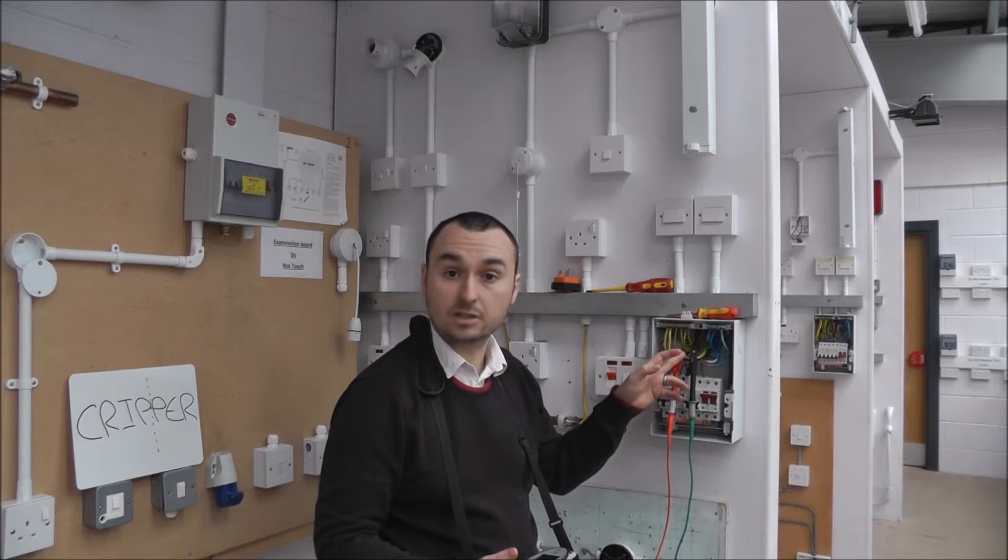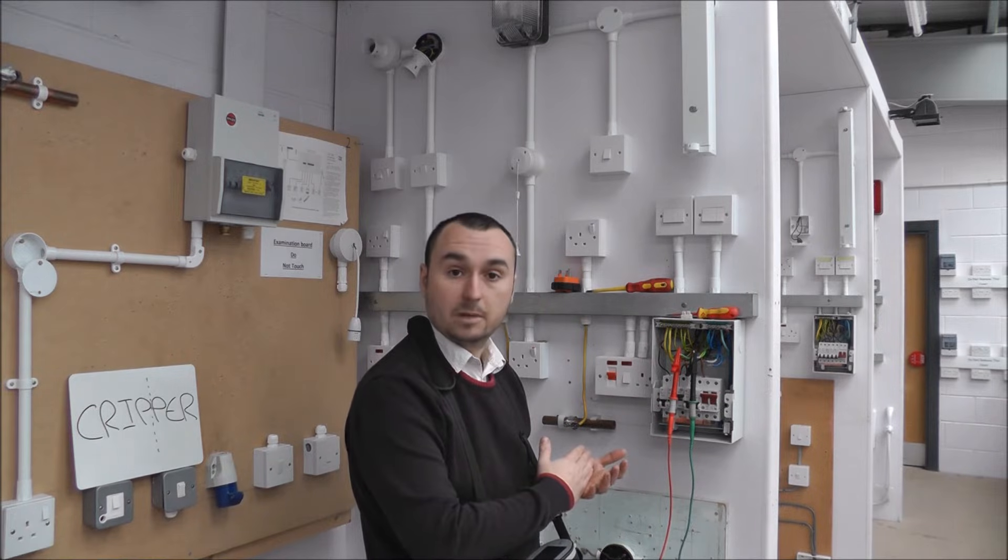That's a successful test. The CPC is a slightly smaller size than the other two conductors. When we get our CPC results, we would multiply that result by 1.67. I will write each one of those results down individually on my test sheet.